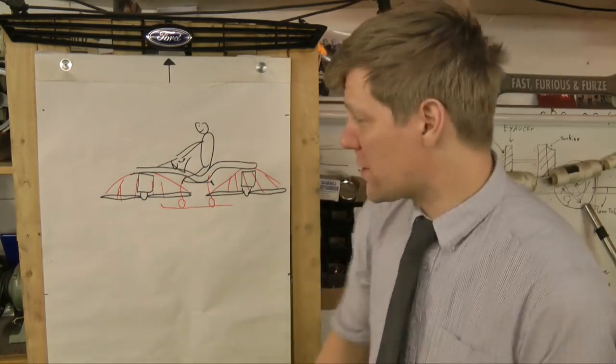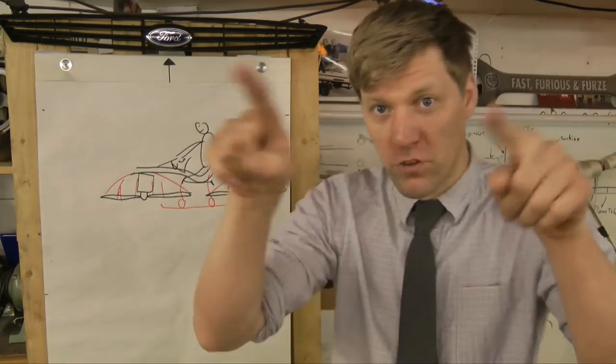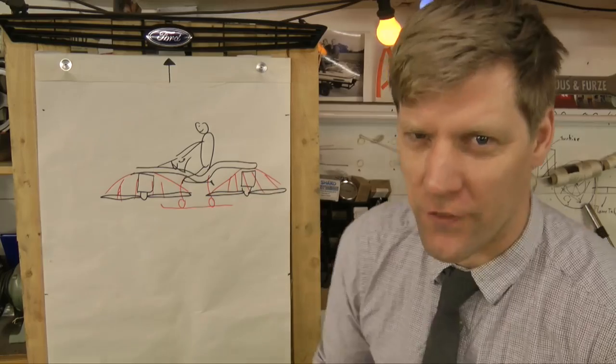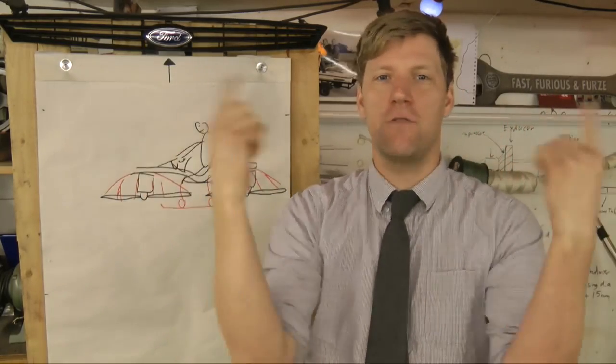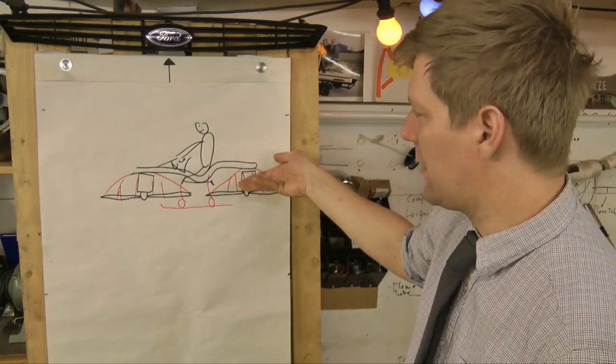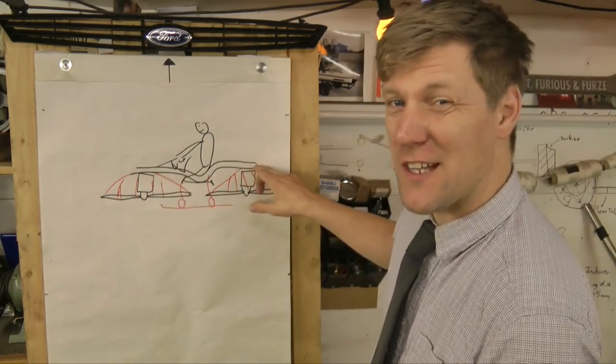Now, I have had a thought in that both of my propellers are going to be turning in the same direction, which will probably give some gyroscopic spin. Because if you think of a Chinook, they have two propellers and they run in opposite directions. So, I'm going to have to flip one of the motors up on its back, which means this chassis going straight is probably not going to do.